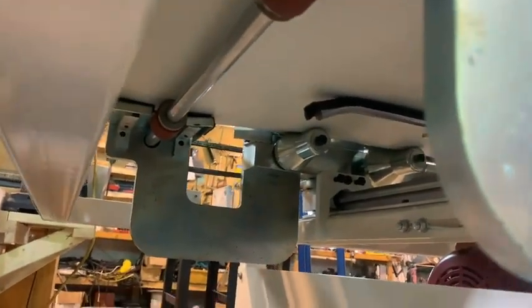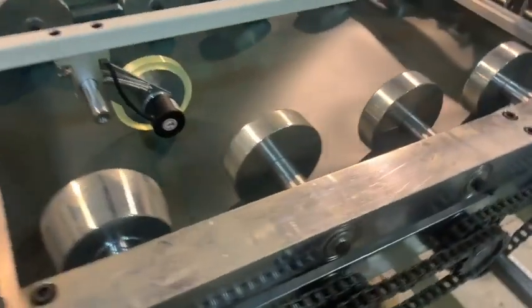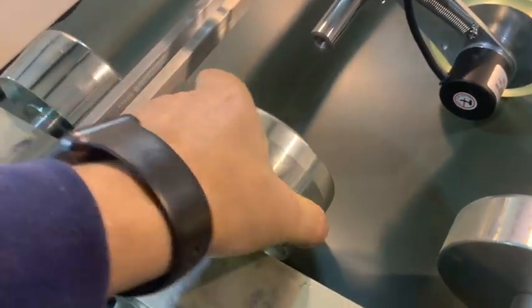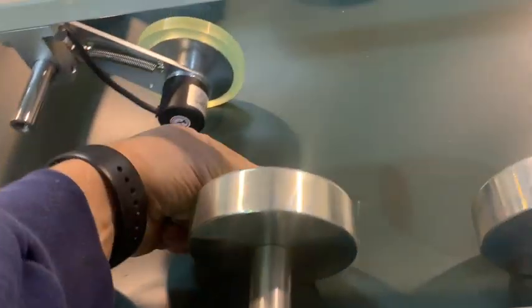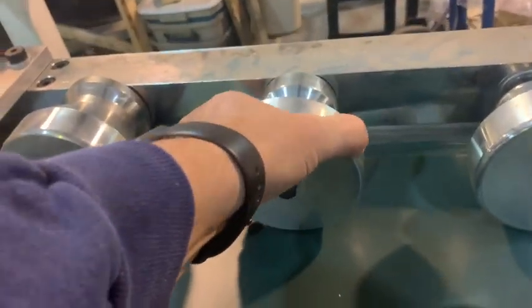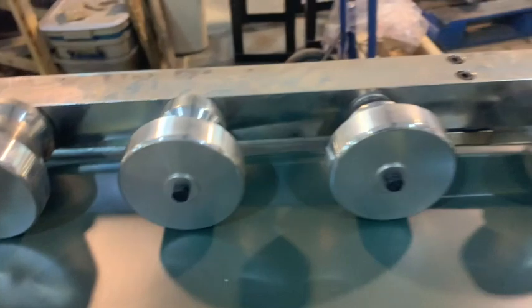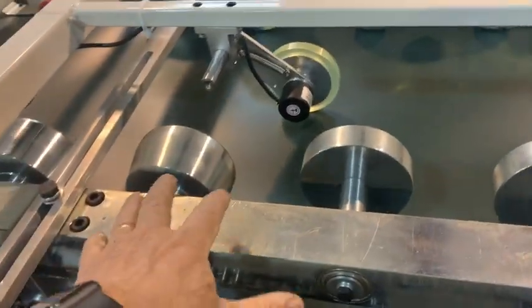The urethane drive rollers are on cams, so you can loosen this and raise or lower it. On the bottom, the bottom also has urethane drive rollers underneath. Once you begin to come into the main part of the machine, you should be able to slightly turn these — see how I can turn these a little bit. They do touch, but they're not too tight. You don't want them too tight; you should be able to slide a piece of material in and it should touch but not be real tight. See, I can turn that — it's rubbing but I can still turn it. That is a correct adjustment.